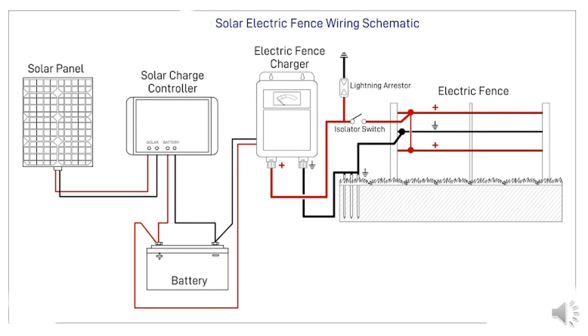We also have hooks and batteries. Remember, the fence can also be energized with solar power — it's not required that you use the grid. You can use solar power, in which case you'll need the solar materials covered in my previous videos. The solar setup goes: solar panel, charge controller, battery, energizer, then to the isolator which is the switch, and then to the fence.